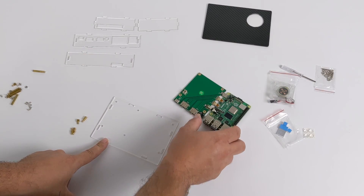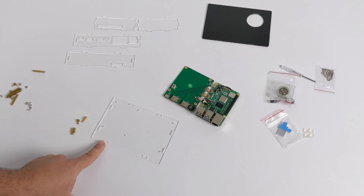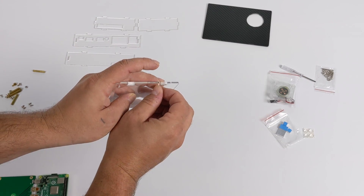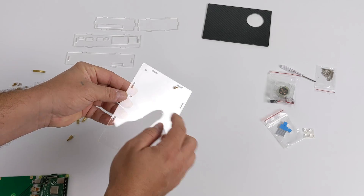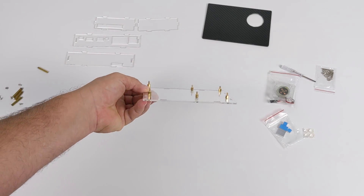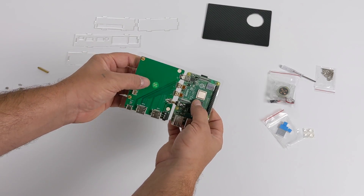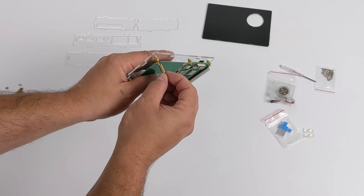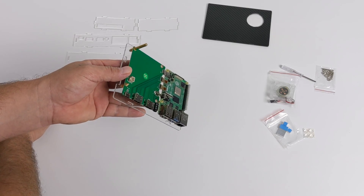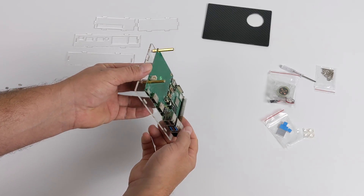Assembly seems easy enough. It does come with standoffs, though it didn't come with any instructions — they might have some on their website, and I'll leave a link in the description if I can find some. This kit comes with a lot of standoffs in two different sizes. I'm going to grab the base plate and place the smaller standoffs on the Raspberry Pi 4 side, and the longer ones go on the add-on PCB side. We slide the whole unit right onto the base plate, grab the longer standoffs to hold everything down. There are also two extra nuts that go on the side for the Raspberry Pi.